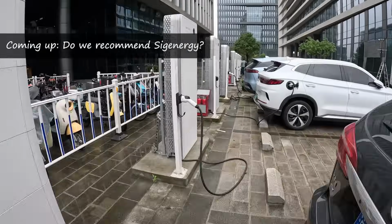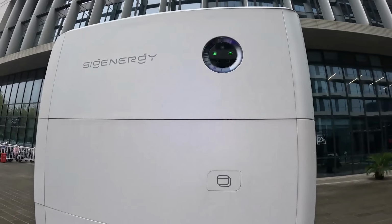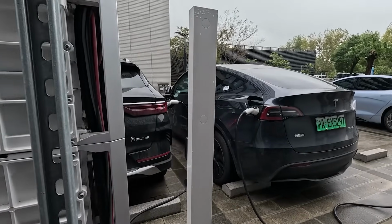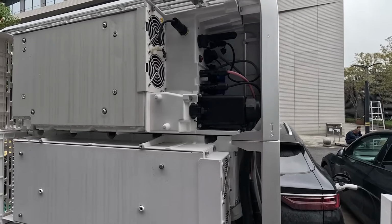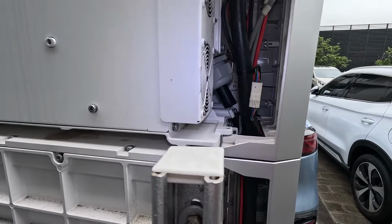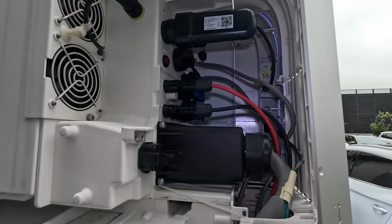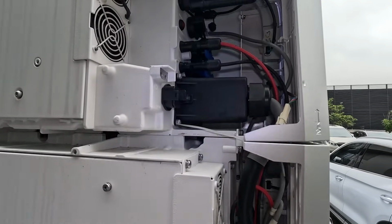So one thing, and there's a bunch of sparkies standing around the batteries that came on the trip with us. And they have, on the left-hand side of it, all the cable management. And we'll throw some imagery up here. I was a little bit concerned as an installer myself, who's really concerned about UV rating, especially in Australia, if you've got that battery on your house for 20 or 30 years. And just this rough cable management work, where if you set the battery off the wall, a kid can easily get their hand around there and grab it all. But not only that, just the longevity of these loose cables sitting out there, well, a rat can get in, like not a rat, a possum can get in there.